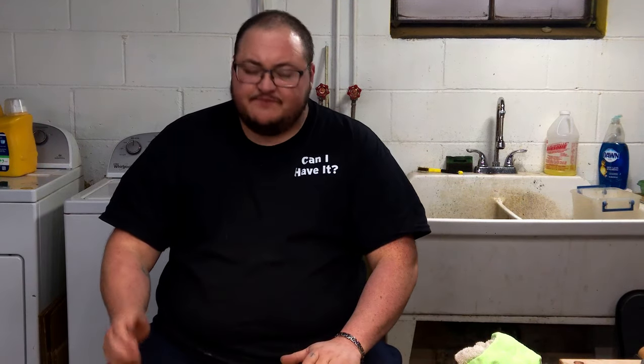So there you have it. I don't want you guys to stress on this at all. That's the most important thing. You do want to try to get it to match whatever you do on the stone because that's the micro bevel that you're on. But don't stress. That's all going to come in time. You're going to figure it out. Just practice. That was the basics. Practice the basics, and you're going to start noticing different things. If you go a little bit higher on the stone, you've got to go a little bit higher on the strop.